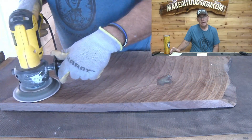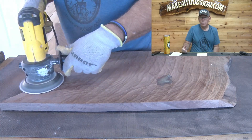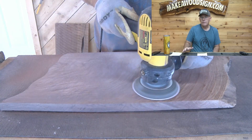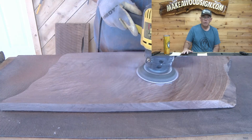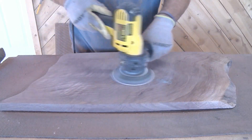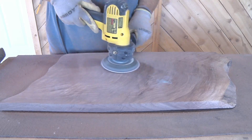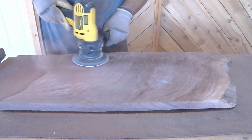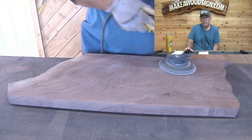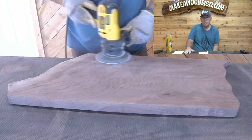First, I have to explain something. I planned on doing this cut with the jigsaw but it didn't really work, so I went to the bandsaw — and unfortunately I didn't film that, so I did it off camera. Then I surfaced this whole thing with the 40 grit disc sander. Next I needed to surface it down even more; the 40 grit took it rough, so I decided to go ahead and use 60 grit as well.